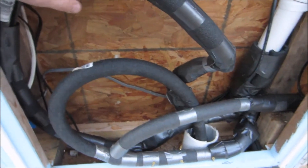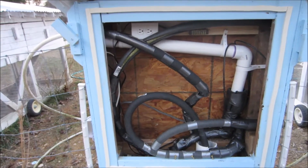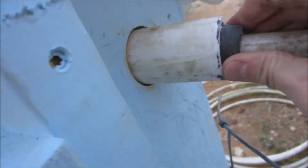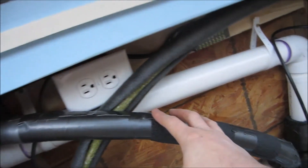This is kind of a big hairball. PEX always ends up kind of being a hairball, but it's mostly because of the confinements of this box and my unwillingness to break out a bunch of right-angle parts to organize it. Anyway, this is pretty much done plumbing wise. The electric will be a significantly smaller area — just a little box inside there. You can see these sticking out — this is sort of the anti-freezing point. Beyond this it can freeze, but it shouldn't because all of this will just drain out via gravity. Everything within the box hopefully won't freeze. I'm leaving some of this exposed partially because I just ran out of foam, but I don't think it really matters even if it does freeze. If it's a problem, I can always add foam later.